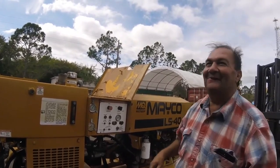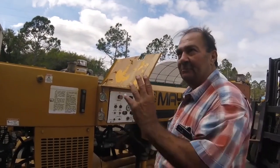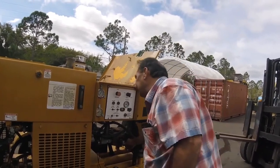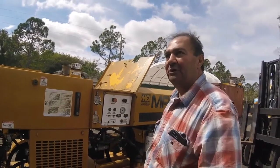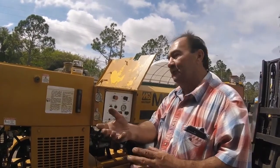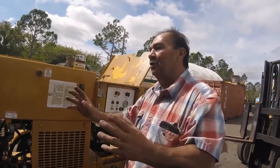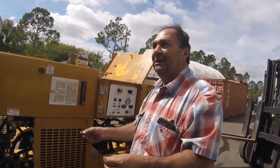Okay, so now basically I'm ready to go ahead and clean the pump. It has to be done in reverse. Okay, so now it's in reverse. Basically it's the same process. I don't need this to be shifting, so I'm going to idle this down, that's the way I would prefer to do it. Okay, so then basically I'm going to watch volume come out because the swing tube will swing off. Volume comes out of that cylinder, but it's not completely clean. Okay, whatever debris there is, I'm going to do it again, but as I go 2 or 3 times, strokes or whatever, it's going to get to where it's pretty clean.